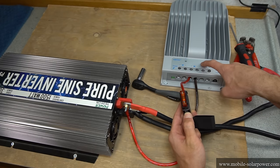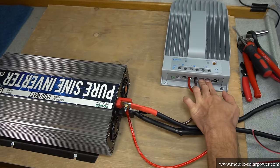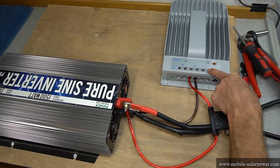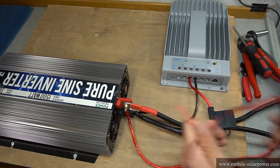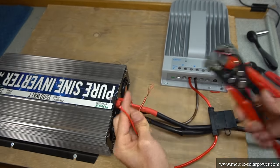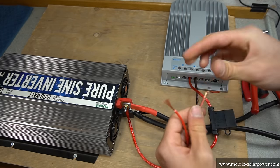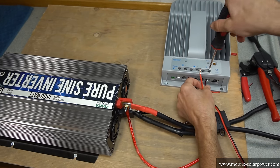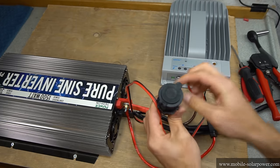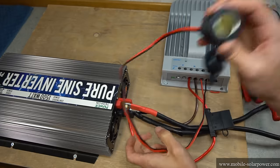Remember: 50 amp fuse for a 40 amp solar charge controller. Now we're going to add a cigarette lighter adapter and put it in the load terminals of the solar charge controller, because this has 20 amp short circuit protection so we can use the internal fuse to safely connect it. First we need to strip these wires — because they're pretty tiny, we need to fold them in half to fit the small input terminal. Then put it in the hole and tighten it down — negative goes to black, positive goes to red. Now we have a cigarette lighter adapter and you can connect USB chargers or a laptop charger and so much more.